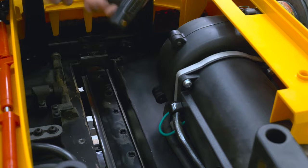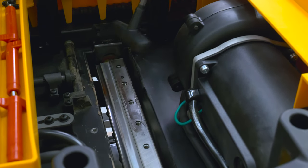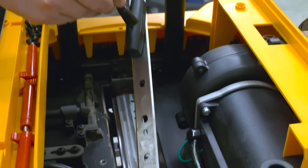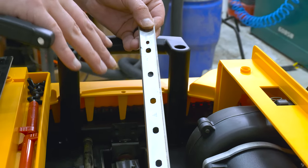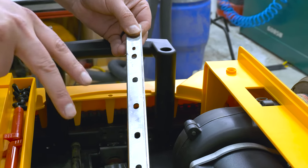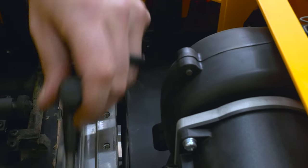The back of the DeWalt tool has these two little magnets on here, which are super convenient because they let you pick up the blades, and when you get to the actual blade itself, this tool lets you pick up the blade without actually touching it because they're obviously really sharp. This blade doesn't actually need to be replaced — I've just replaced it — but I wanted to show for demonstration purposes that there are two sides to the blade, so you can rotate them if there are any issues. And when you're taking the blades in and out, there are also these indexing pins on either end.